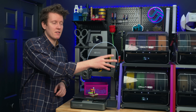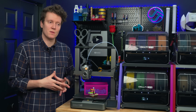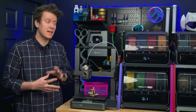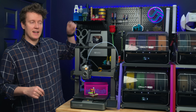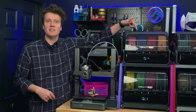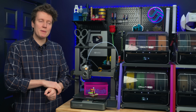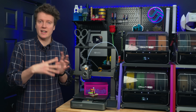The CFS units here are the same as on the K2, so if you have multiple Creality multicolor printers you can mix and match your CFS units. They come with two universal ports on the back — you can use either one and just connect them in serial. From the buffer on the side, you connect buffer to the top port, then from the other port to the next one, and so on back into the printer. This makes it really easy to customize your setup however you have your printers and CFS units connected together.